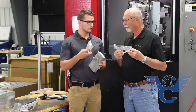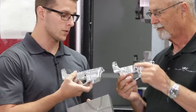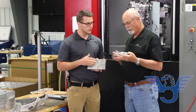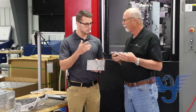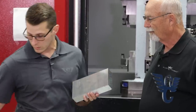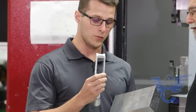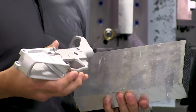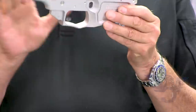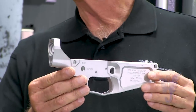And from the same block we also get the AR-9, which is overall the same size and weight characteristics but with a different machine magwell. And it comes out with a logo and the markings and everything on it? Logo, engraving, serial number, everything's good to go. We're also able to, with a few quick changes on the fixturing, put the AR-10 blocks in there — which are quite bigger and heavier — to get the AR-10. Same process, basically got to go through the broach, but you get the engraving, the serial numbers, the logos, everything included. And this one's got the final bead blast finish on it — it's already been bead blasted and it's getting ready to go out on a shipment to get the anodize put on it.